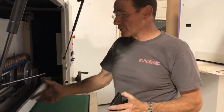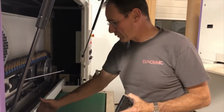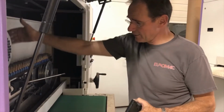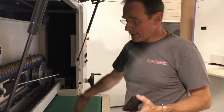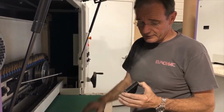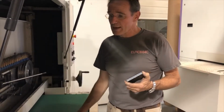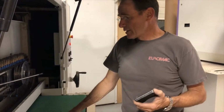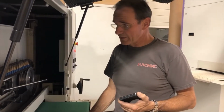Other than that, we need to go to a machine that is specifically built for these brushes, where the conveyor belt goes in, then there's a gap, then there are some support rolls, and then there's another gap for the back belt, and then a conveyor belt leading out. There I can set the brushes deeper into the material, even if they are temporarily going below the bottom surface in thinner materials. However, the minimum part size on a machine like this is 6 to 8 inches, depending on how wide it is, so that it gaps over this opening on the bottom underneath the belt.